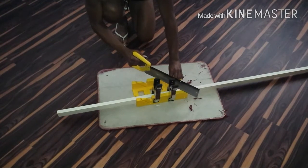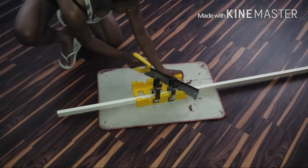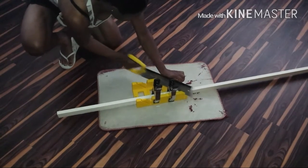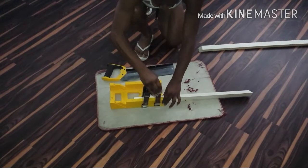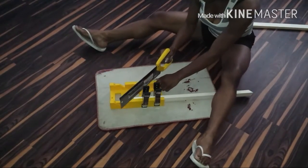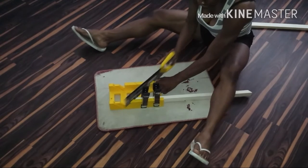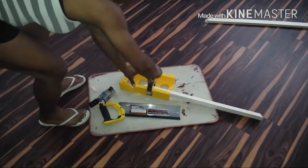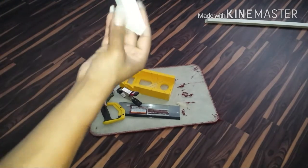The longest part of my air conditioning unit that I need to clear is going to be 27 inches, and the short side 17 inches. I'm cutting the wood at an angle — cutting the one-inch side at the angle because this is going to be the frame around the air conditioning unit. If you don't want to miter the corners or aren't familiar with how to miter and don't have a miter box or hacksaw, you don't have to do it this way — you can always attach them at right angles. However, I wanted a more framed look, so I'm going to miter my corners.